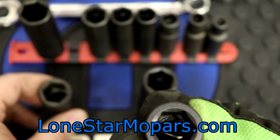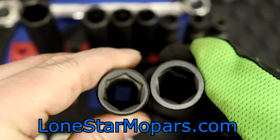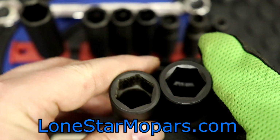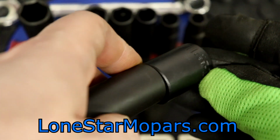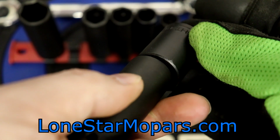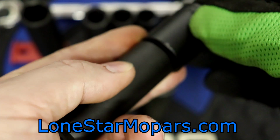There's that sidewall. So 3/8 Wright versus 1/2 inch Wright. Hopefully it conveys that that is a noticeably thicker sidewall, right? Similar structure, similar construct. Look at that. If you can just dumb this down to the point of matching OD to OD, I've got it smooth and flat between my index and thumb finger, and there is a big rise.